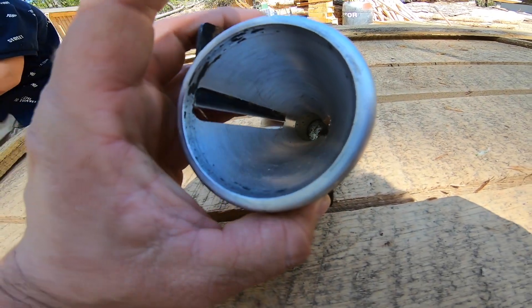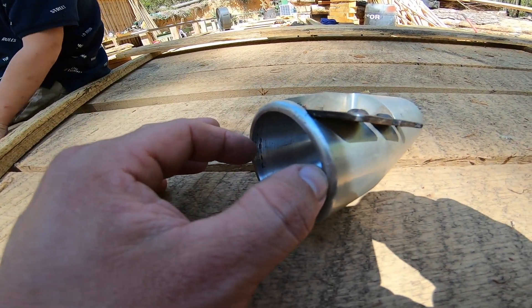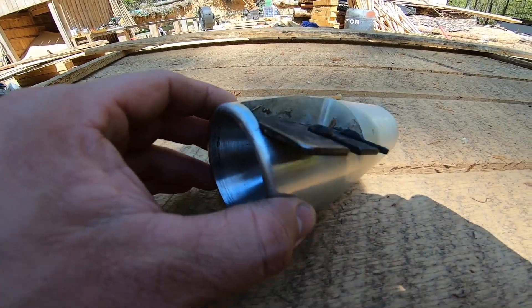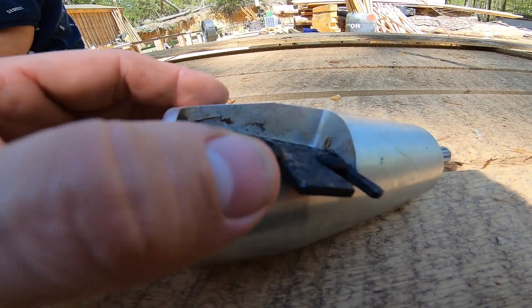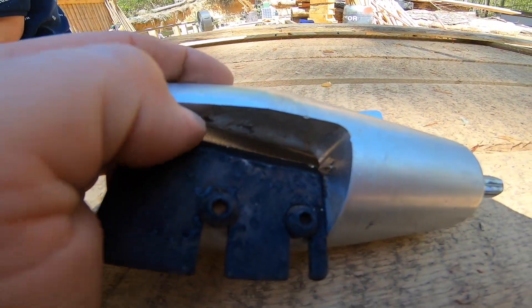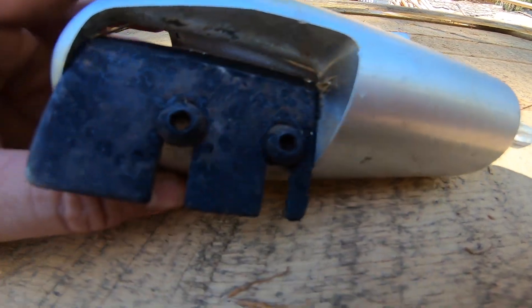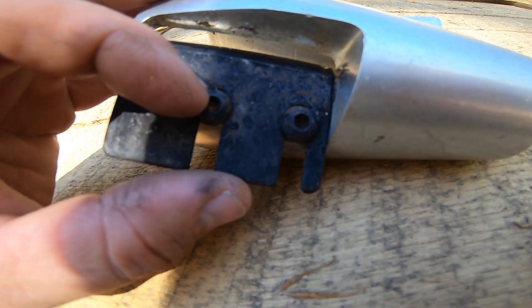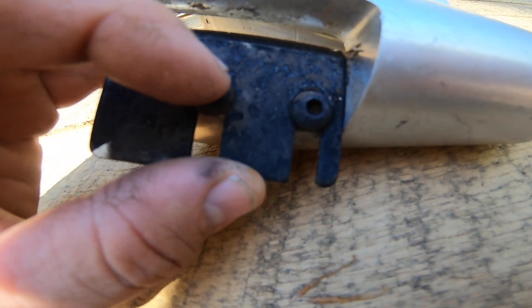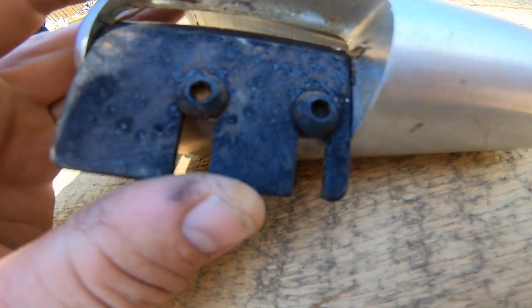On the other one — the one closest to the throat — I had to take the shim out because it wasn't sitting far enough down to cut through some of those knots. There is also a 1/16-inch gap that you can see down between the screw and the blade.